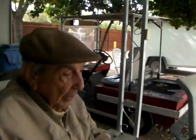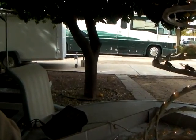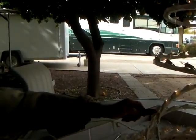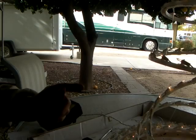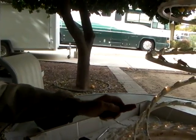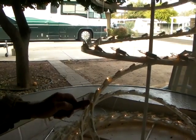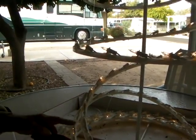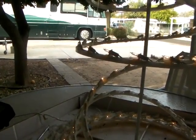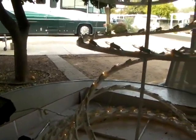Let's look at it this way. If it lights up down here like that, there must be power coming that far. Otherwise, it wouldn't light. Is that right? Yeah. If I go up here and it don't light, there's no power. Right. Someplace between there and here, there must be an open. So we're losing the voltage. Sometimes between that bulb and that bulb, we're losing voltage. And if you're losing voltage, it's because the light is burnt out that don't have the shorting. Yeah. If it had the shorting, we wouldn't have this problem we're having right now.